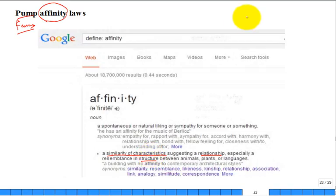What are we most interested in? Flow rates. We're interested in head or pressure. And we're interested in, let me call it, fluid horsepower, some brake horsepower, fluid horsepower, some power. Those are the three things we're really interested in. And once you have a pump and you just build a larger pump, but it's just scaled up, the way they behave is very, very similar. So if you change the dimensions of the pump, you can scale the results through the affinity laws because they have the same characteristics, same shape, same behavior.